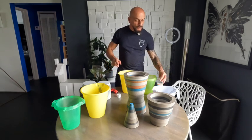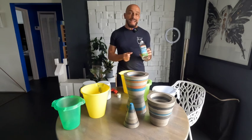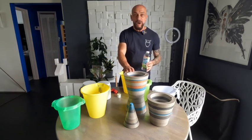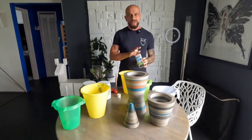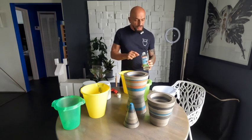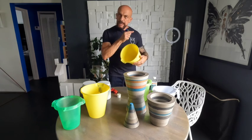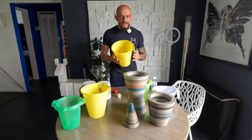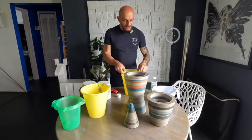Once you have that done, you need to apply a little layer of coconut oil. You can use any oil, actually. What it does is it facilitates the concrete popping out of the molds a lot faster and a lot easier. You brush on a little bit of coconut oil and it pops out so much easier and so much faster once it's dry and set.